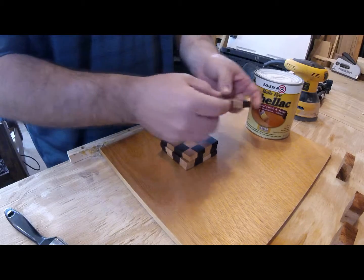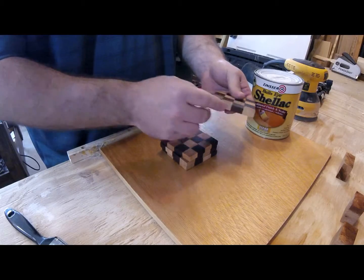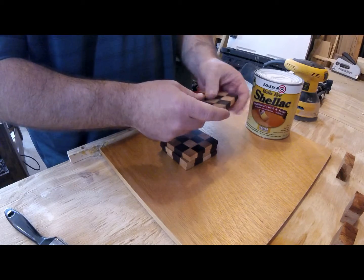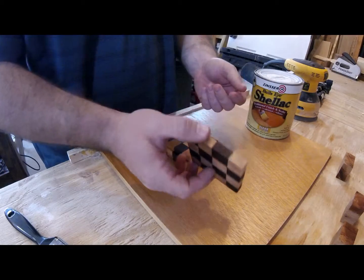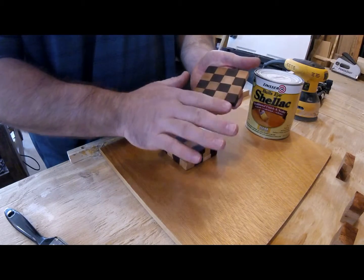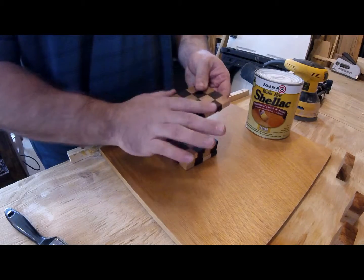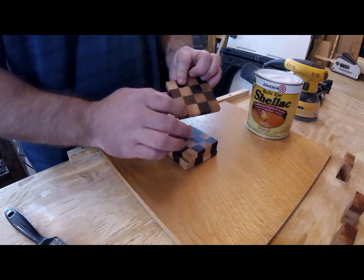So before you do the final sides, you can sand that smooth to make sure you don't have bumps and stuff like that. Again, use your 400 grit, and you can even wet sand it to make it even smoother. I've wet sanded them before, works great. So we're going to put our top coat on, let it dry, then we'll do our bottom coat and go from there.